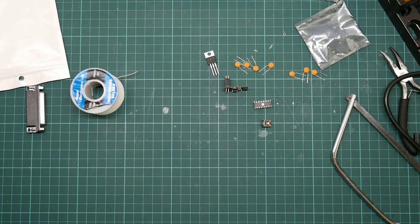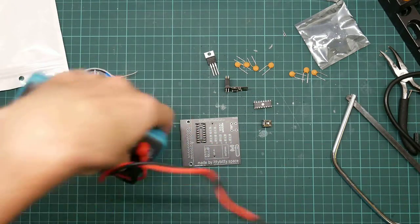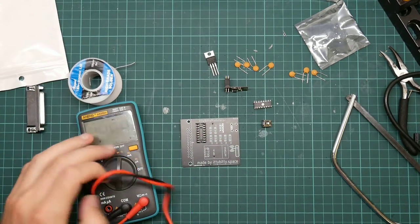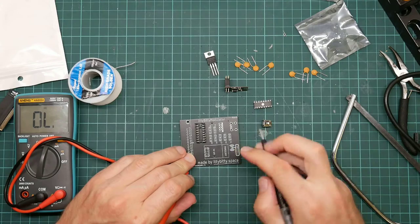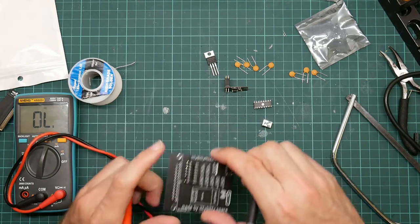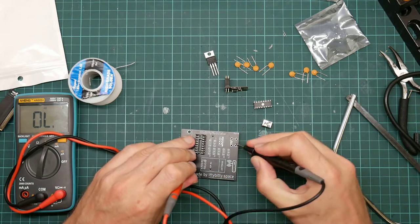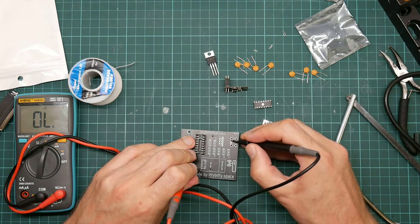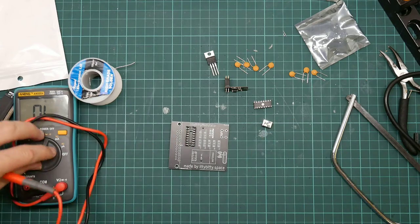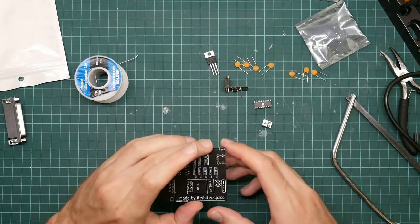I do not believe it is, but actually, we have tools for this to find this out for sure. So, grounding hole. That's not connected. But this one here marked ground is. Yep. Right, that hole is connected to ground. So that will be the USB data ground, as opposed to the shield. They're not quite the same thing, although they're nearly always connected together.